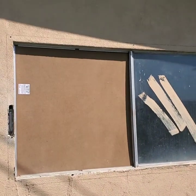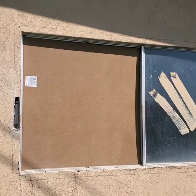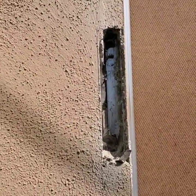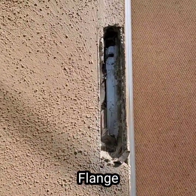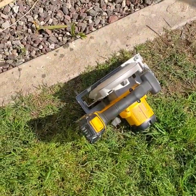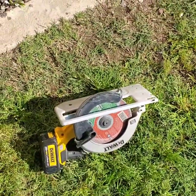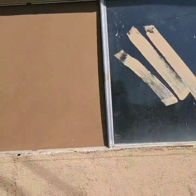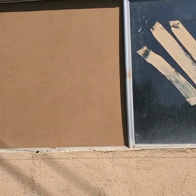What I already started here is I already started to cut the stucco, trying to get back to this lip right there that's onto your wood. I'm using a circular saw with the masonry bit — you can also use a grinder with a masonry diamond blade. I drew a line an inch to an inch and a half all the way around it, that way I can make sure we get it right.